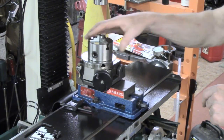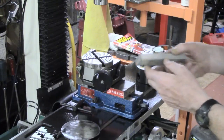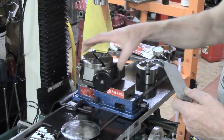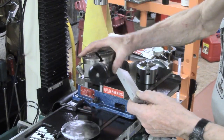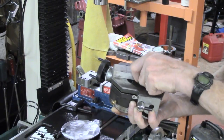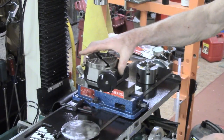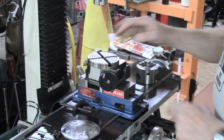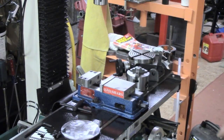It doesn't leave me much clearance, but it's only going to be for milling. I'm sitting on the vise at the moment, which brings me to the other idea. I'm going to machine this piece of aluminum bar — I've seen more than one person do this — and we'll mount the bar to the bottom of the rotary table, which will then allow it to be put in the vise just for a quick job. Otherwise I would remove the main vise and fit this instead.